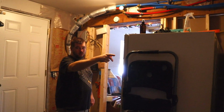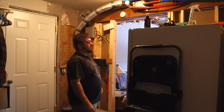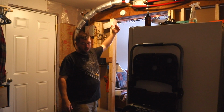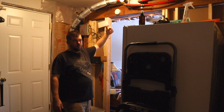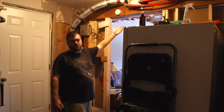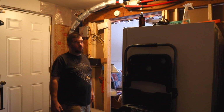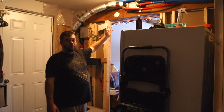I've got a water to air exchanger to get our heat out of the water. So that furnace provides us with instant hot water, and basically hot water for days. We could all take showers and run a dishwasher, fill a washing machine, and never run out of hot water. And all of this is heated by wood.